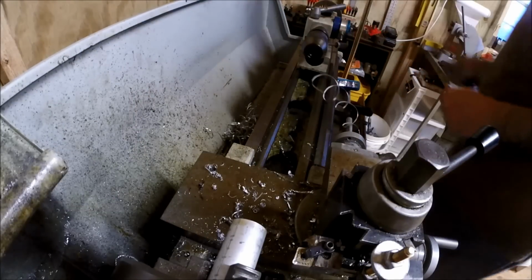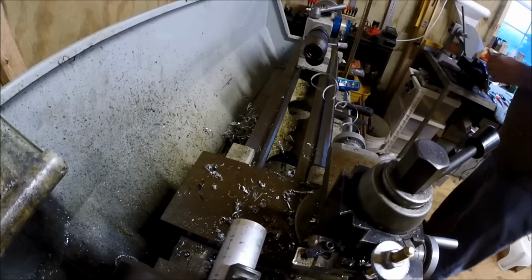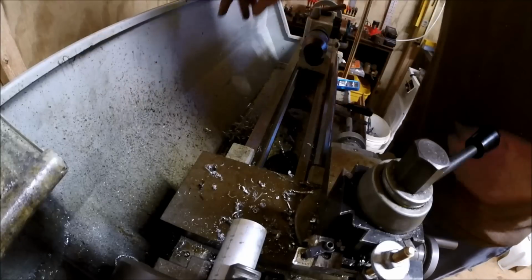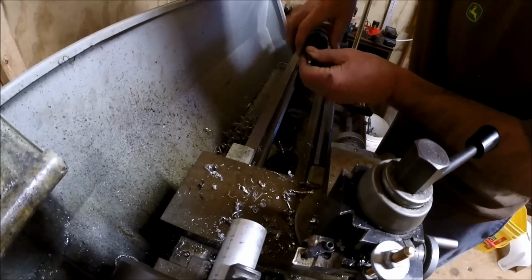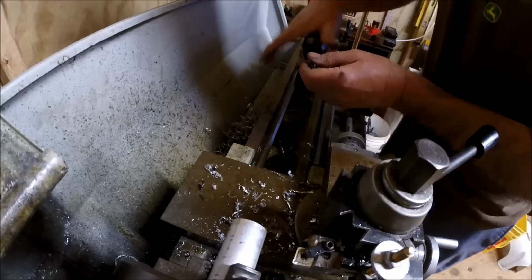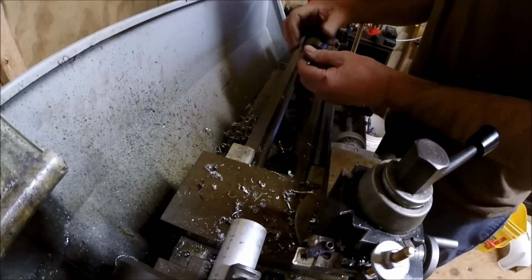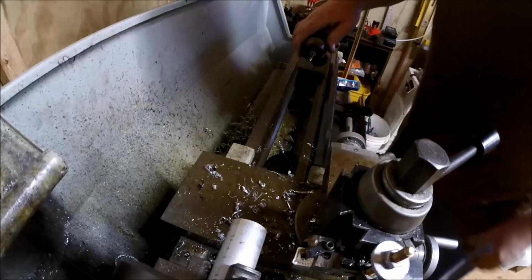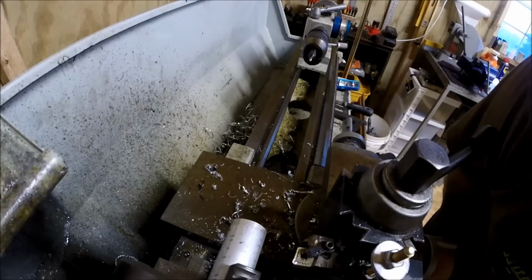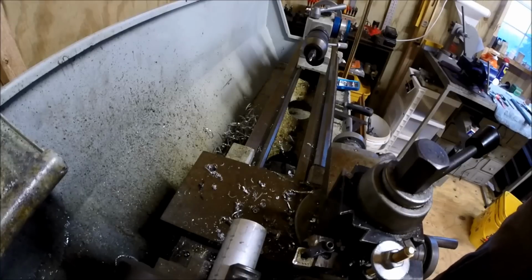Careful how I cut my lathe off anyway. When I wired the shop, if I flip that switch really, really hard, the breaker will kick out when it comes off. An electrician friend of mine said probably what I need to do is, it's on a 20 amp circuit, which should be plenty of amperage, but he said you might want to go up to 25 or 30. This lathe has been rewired.